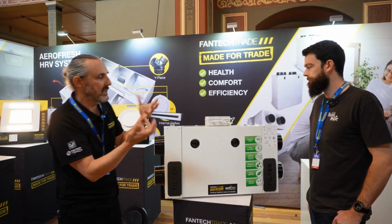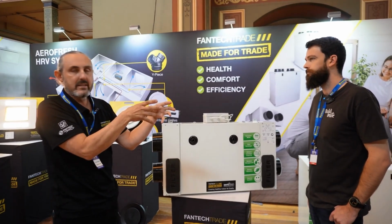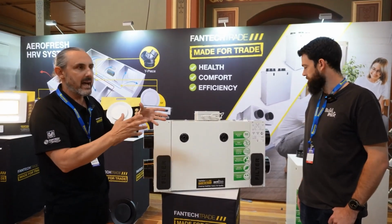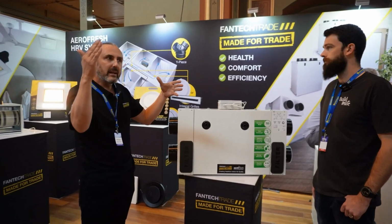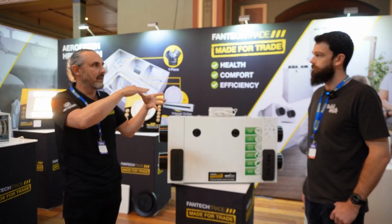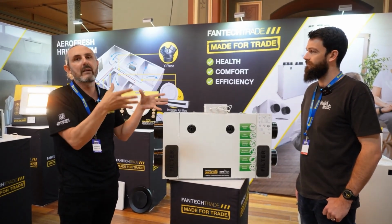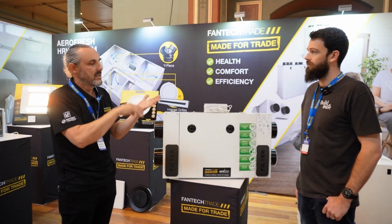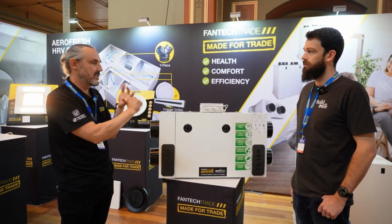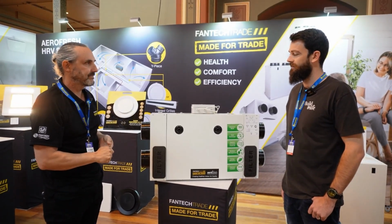And so the really quick analogy I like to do, in summer, for example, 20 degrees inside, 40 degrees outside. Let's say the unit's about 80% efficient. We can get 40 degree air down to about 24 degree supply air. So rather than having your windows open where you'd have 40 degree air come in, you're actually getting a really low temp. So comfortable and much lower energy consumption on your AC system. That's an incredible difference in temperature. It is, it is. Yeah.